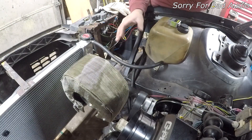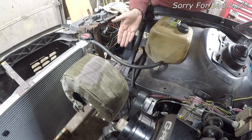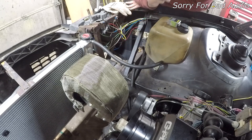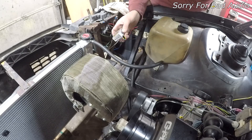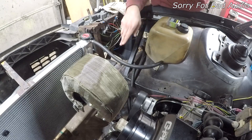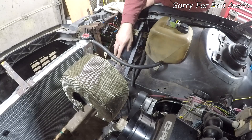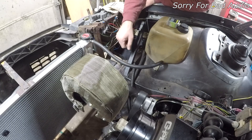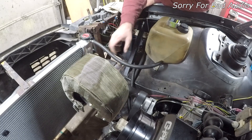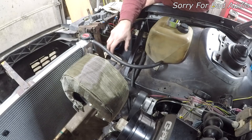I think I'm definitely going to have to fix this and level it out — maybe go a little bit positive up, so when the weight of the turbo goes on there it will sink it down just a pinch — but it's just angled the wrong way. It's going to be really hard to see the gauge when I have it on there to weld. So I'm going to try to break those welds — probably this front weld — lift it up, hopefully break the back welds, then weld up front to hold it at maybe plus 5 degrees. Maybe that'll level it out, hopefully.